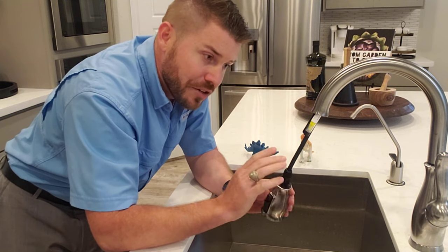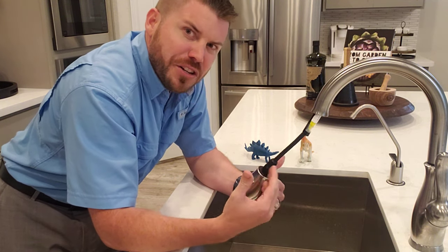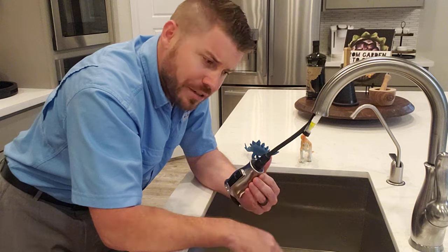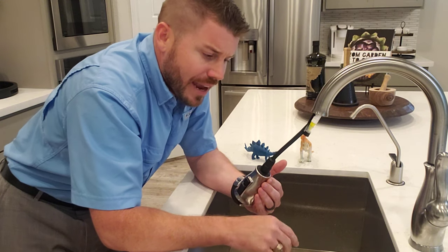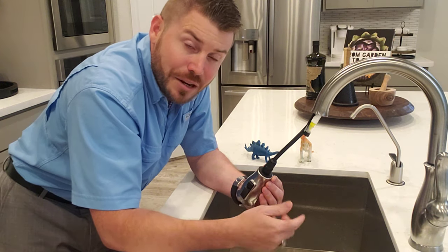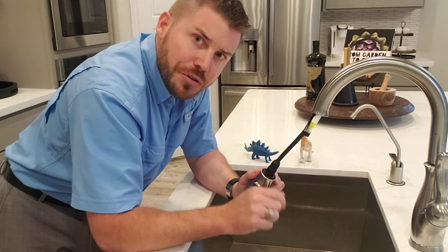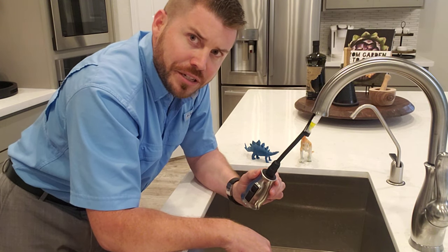In new construction you have new plumbing lines that are put into the home, and oftentimes there's dirt in a new development that gets in those lines during construction. In the first few days and months as water runs through those lines, it's gonna flush out some small sand, dirt, or mud that gets in that line. Where does all that wind up? Right here in the head of this faucet — it will slow it down, and it can affect your bathroom faucets and your kitchen sink. Mostly your kitchen sink because you tend to use it more.